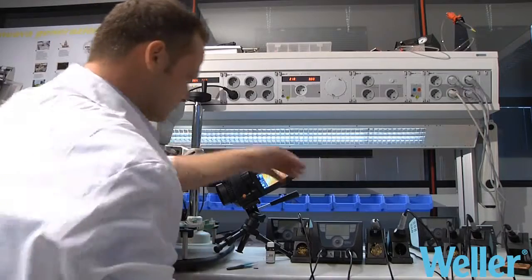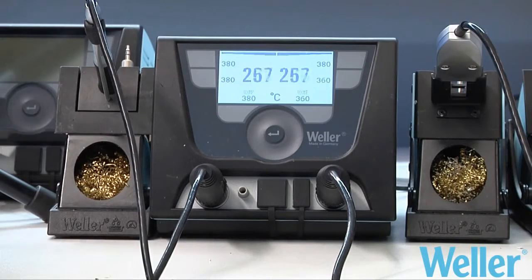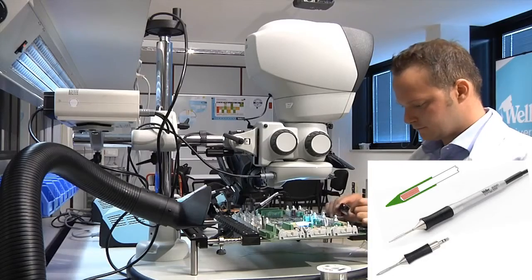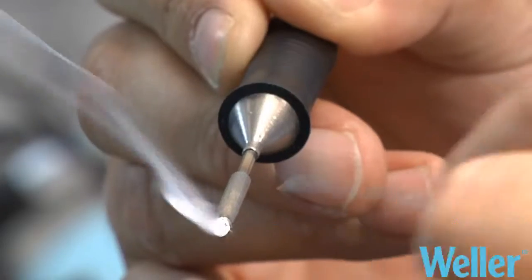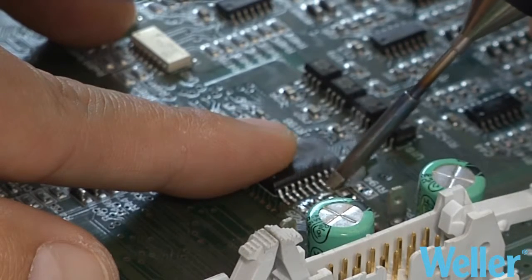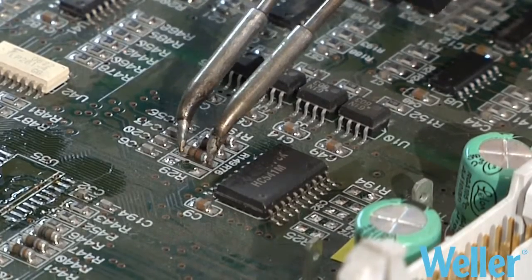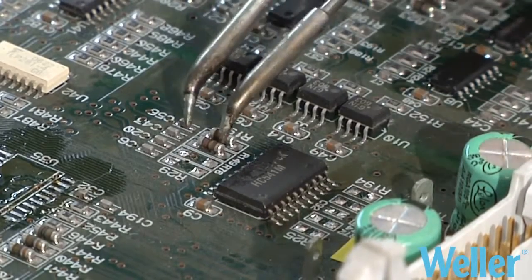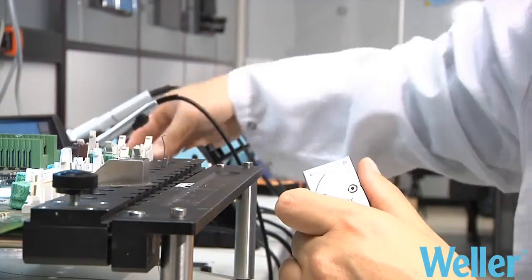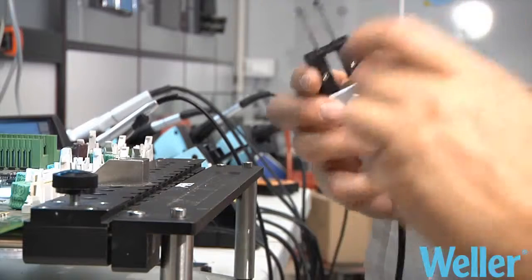Active Tips. For micro-electronic applications with high heat request, it is the fastest technology for heating and response. A micro-tool particularly useful under microscope, and a micro-tweezer very useful to desolder passives or dual in-line components, also with heavy ground connections. Both tools have a fast and easy tip change system.